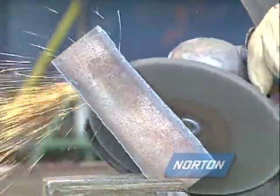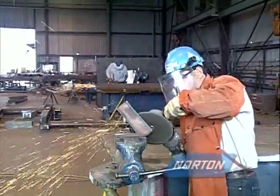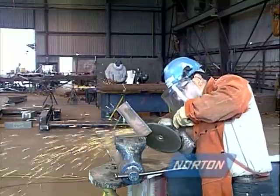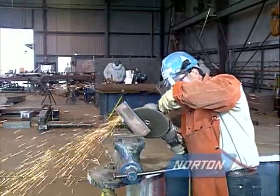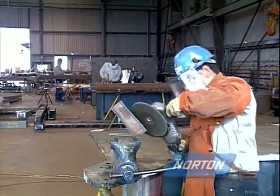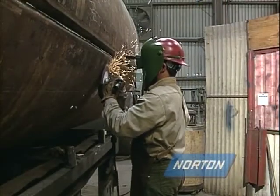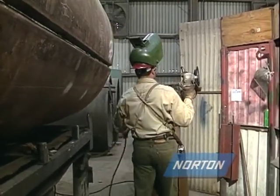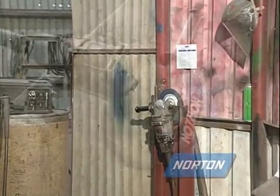This is a nine-by-quarter-inch type 27 grinding wheel. Notice the operator is grinding on the correct surface. The guard is properly placed between the grinding wheel and the operator. When this operator is done grinding, he will allow the wheel to come to a complete stop and place it in a safe storage rack. This storage rack is a permanent fixture and part of this work bench. When a machine and wheel are put down, even for a short period of time, they must be stored correctly — never dropped or placed where they could be pulled off a table or bench onto the floor.